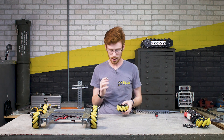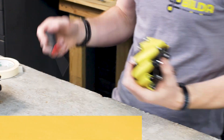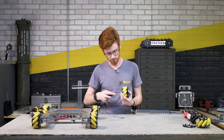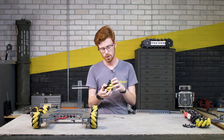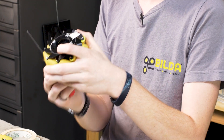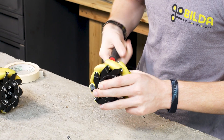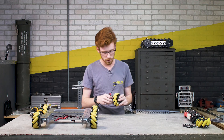You'll need a 7-millimeter wrench or driver and a 3-millimeter driver. You have four M4 55-millimeter-long screws and you should be able to pull those out. When you thread them out there will be a fairly tight fit between the plastic and the aluminum, so make sure you get each screw just below the face of the 2-millimeter aluminum plate. Repeat that process on the other three screws — the fitment will probably keep the screws in place but feel free to remove them entirely.